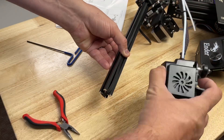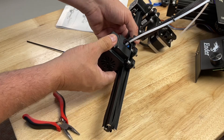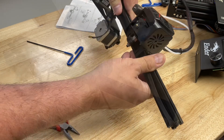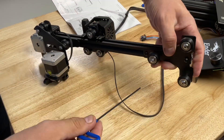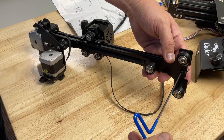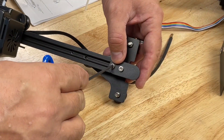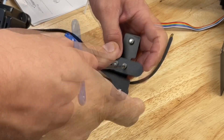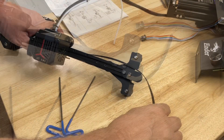Pinch the belt against the crossbeam and then slide the hotend assembly over the top of it, making sure it's on the correct side opposite the extruder. Now install the opposite side bracket — it should fit into one location and there are two screws to hold it in place. Install the belt idler on the opposite side of the bracket. It has two T-nuts to hold it in place, so tighten one first, then do the other, but leave it loose enough because we're going to adjust it.